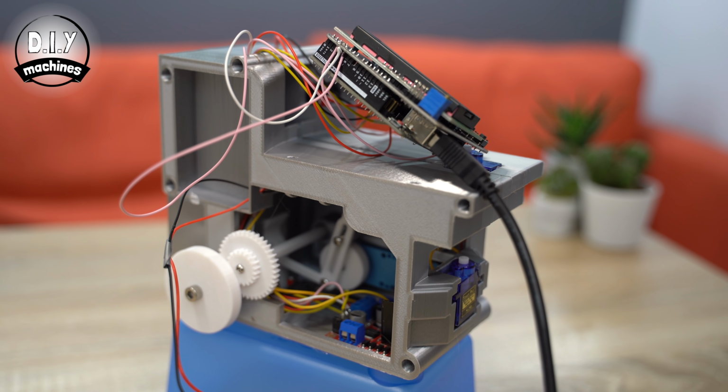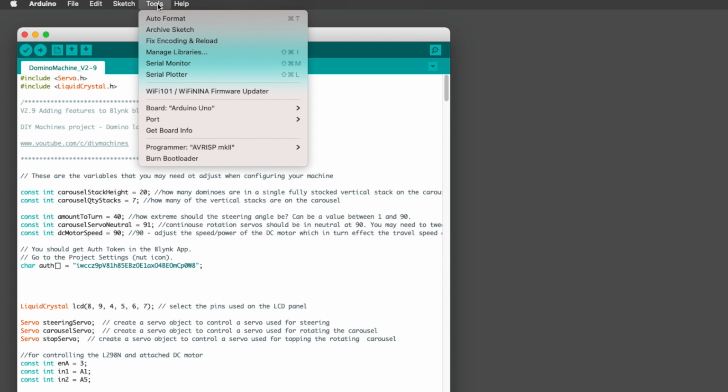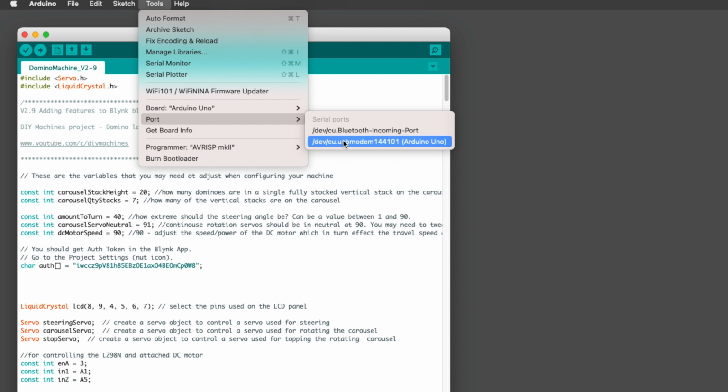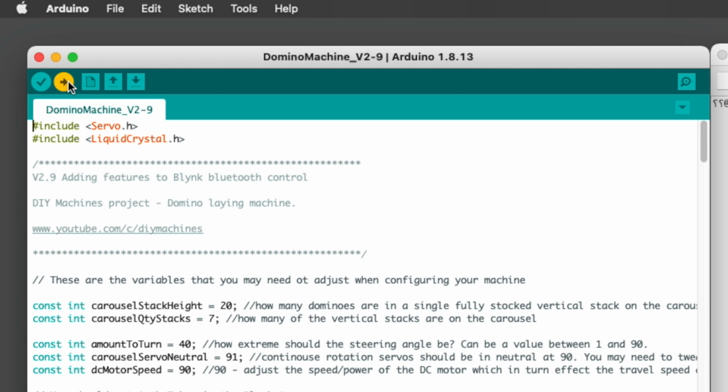Connect your Arduino to your computer with a USB cable. Download and open the code, there is of course a link to it in the description. You can then set your board type to Arduino Uno and also ensure that you have the correct port selected before pressing upload. If all goes well, you should see your display light up, but don't panic if you can't immediately see any characters on it.